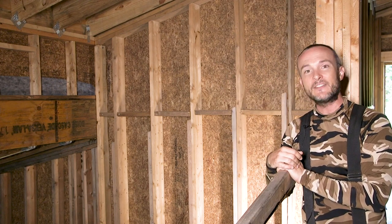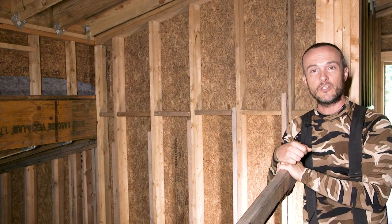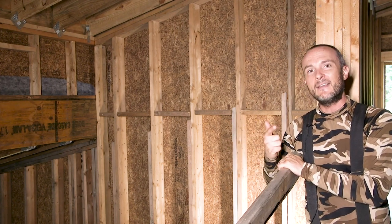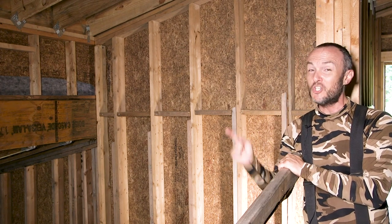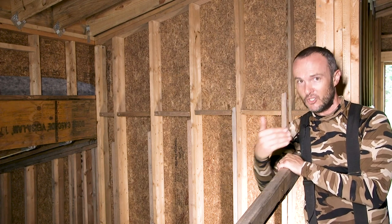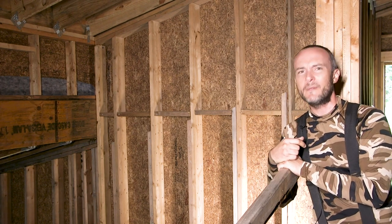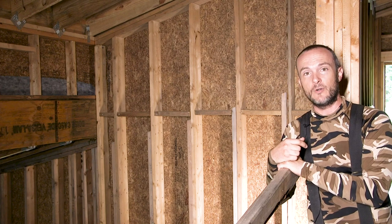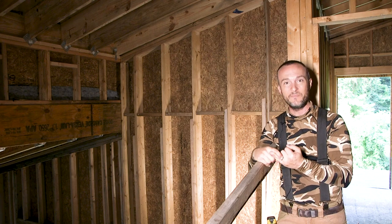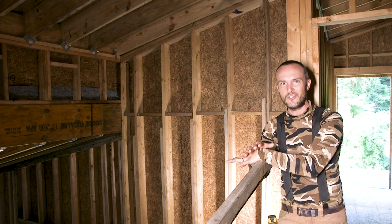If you wanted to fill that cavity, you could inject cellulose, fiberglass fibers, or blown rock wool — which is what we're using for the insulation in this entire house. But I would have to rent a blower just for this one little mistake. A normal builder is not going to rent a blower just to fix one small problem. Instead, I'm going to show you how you're actually supposed to do this — and it's not as hard as you'd think. We're going to go up on the roof to do it.